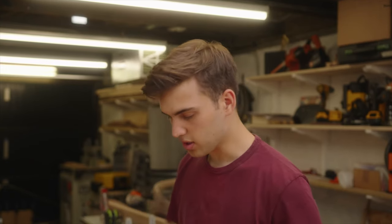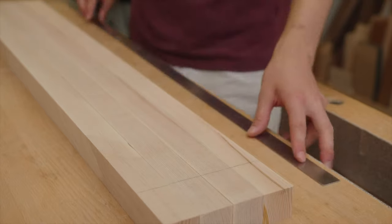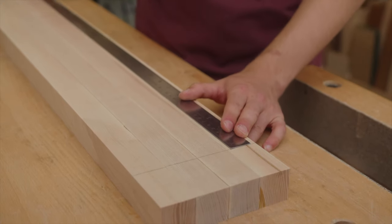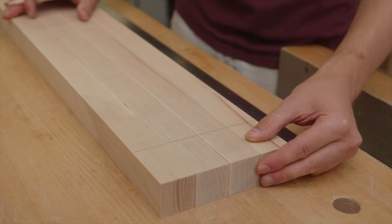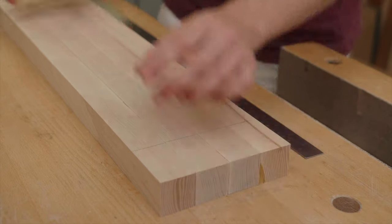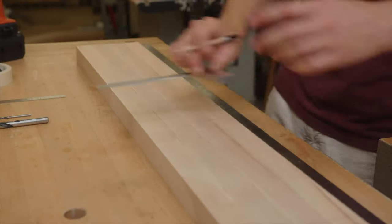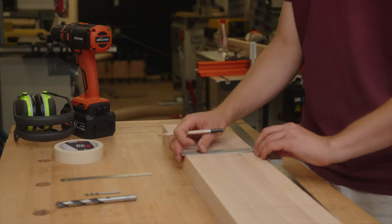To mark out the holes, the shelves are 30 centimetres apart. I've already marked out the first shelf which is 6 centimetres up from the base of the bookshelf — that line there is the middle of the shelf. The next shelf is going to be 30 centimetres up and I'll mark that with my pencil, then use a long square to mark all four boards at the same time. That ensures the marking line is in the exact same location on all four boards so the shelf will be level. The last shelf is another 30 centimetres up from the second shelf, and again I'll use a long square to mark all four at the same time.